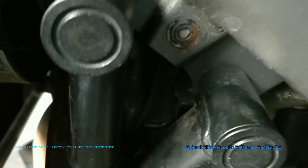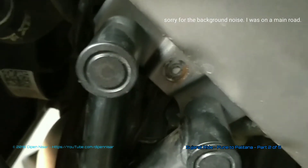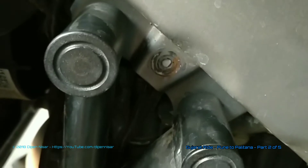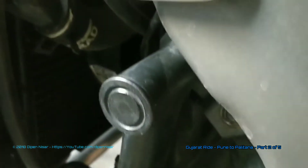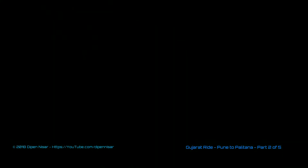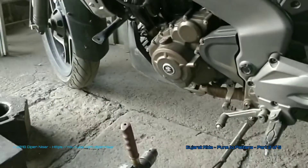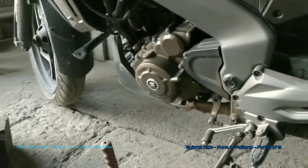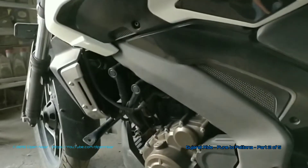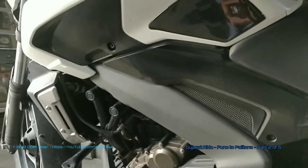Here is the bolt that is stuck halfway inside. The fabricator here has suggested not to weld it, but just to drill it out and re-bore the size 10 threads. Once he starts doing that, I'll show you — he'll use that drill machine to drill the hole out and drill the bolt out so it makes space for a new bolt to go in.